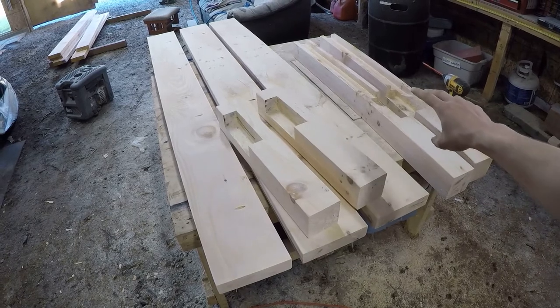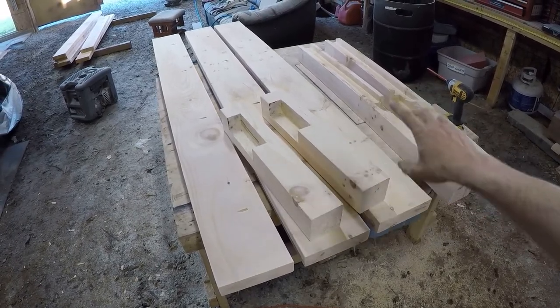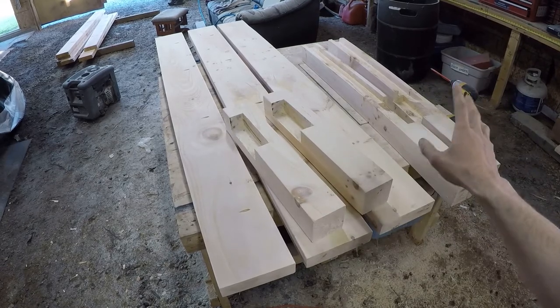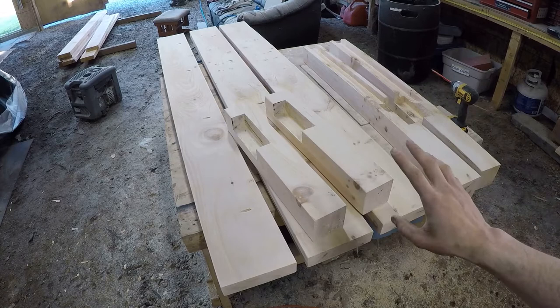What I'm going to do now is fasten the headboard pieces together and fasten them to the 4x4. Then I will stain everything and put a finish on it, because those are going to be permanently together. Everything else will be assembled on site. I'll put a finish on everything and then dry fit it to make sure I don't have to trim anything up.